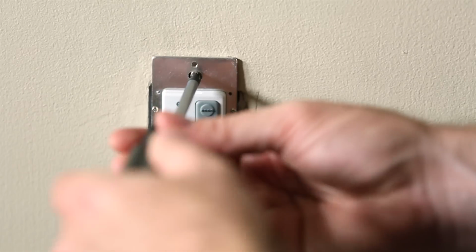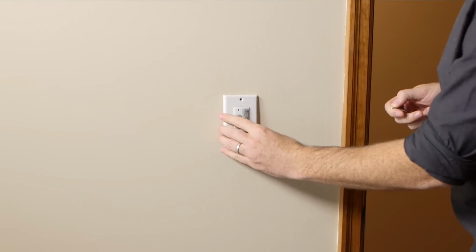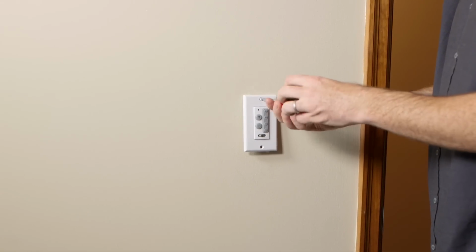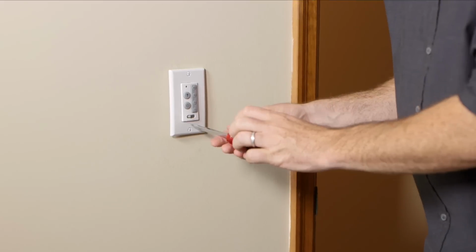All wiring must be in accordance with the current national and local electric codes. Use the national electrical code if local codes do not exist. The ceiling fan must be grounded as a precaution against possible electrical shock. Electrical installation should be performed or approved by a licensed electrician.